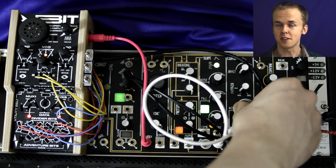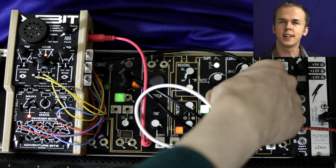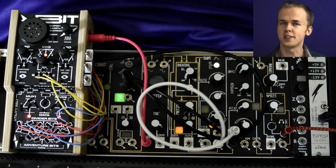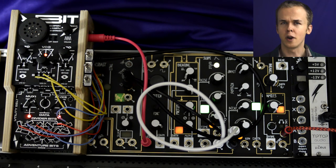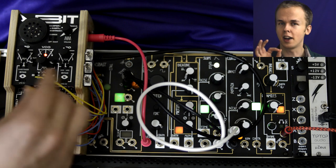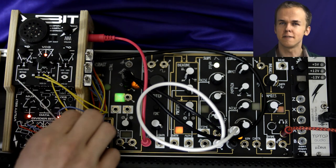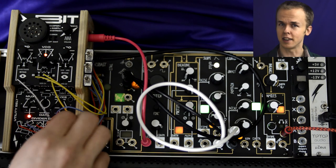You can make it even more interesting by taking a slow loop from the slope generator and using that to modulate parameters like the envelope's decay time. To make it even more dynamic, let's patch something to the Bitranger's LFO-CV-In — this will add swing! Remember, where you patch the ins and outs on the Bitranger affects the strength of the CV signal. The leftmost socket is going to produce the weakest signal, and the rightmost the strongest. A stronger modulation will give us a very artificial, pronounced, but maybe interesting swing.